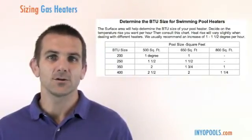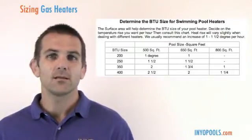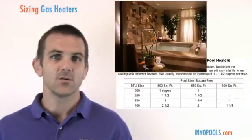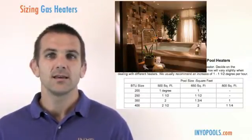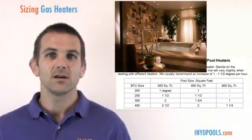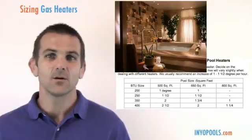So going with a larger unit is quite a bit quicker — you just want to determine what's suitable for your application. If you also have a spa, heating is typically measured by how long it takes to heat the spa 30 degrees. On a standard 600-gallon spa, a 250,000 BTU heater would take 45 minutes, while a 400,000 BTU heater takes roughly 28 minutes — about half the time. So if you want to turn the heater on after work and jump in quickly, the larger heater may be a good option.